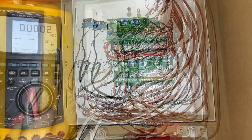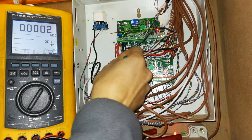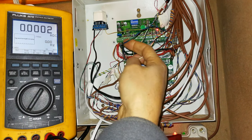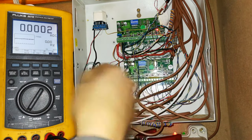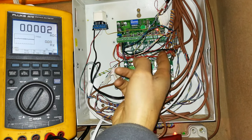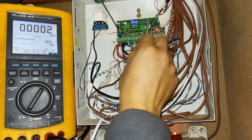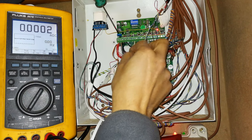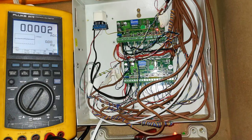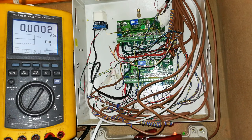I'll just use an ammeter. What I'm going to do is remove the infeed from my battery bank — this is my battery bank wire coming from my 18 amp power supply. I want to measure the current feeding this whole setup: these two expanders, the remote receiver, and all the little red wires from all the PIRs and outdoor sensors. I'm going to disconnect the positive and measure the total drain on this 18 amp hour battery, then work out the standby time and see if I need to extend it.